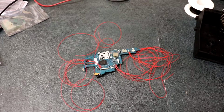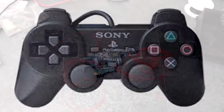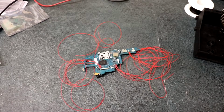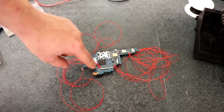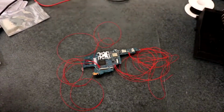So I think first thing we'll do is focus on the joystick section, which is pretty easy for the 3000 and 2000 models, because you can actually pull a joystick directly off that and solder the pads straight off the actual joystick without having to modify this plug at all, which I'm going to show you this episode. We didn't look at last time with the 2000 models.